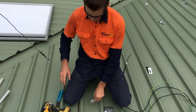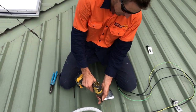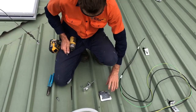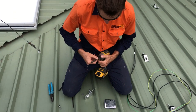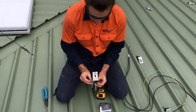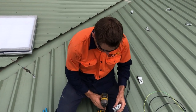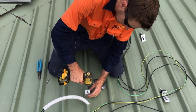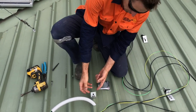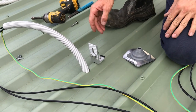If we have a look here, we have our existing fixing points and existing screws, and what we do is take one of those out and replace it with our larger screw and tin bracket. You can see the size of this newer screw is a lot deeper and also a thicker gauge, to make sure it has a really good bite in the batten inside the roof. That just goes in like so — the rubber foot makes sure it's all sealed, and the rubber seal around the top of the roofing screw is sealing it all up so that's completely watertight.